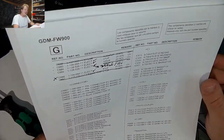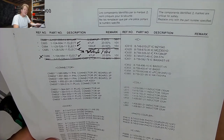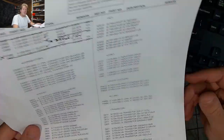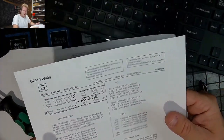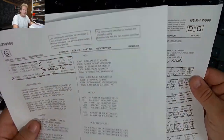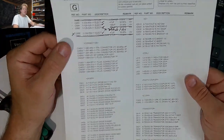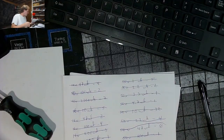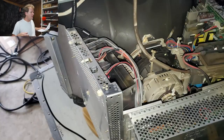Now, some interesting things on the G board cap list: C685 — in the manual it lists a 10 volt, 100 microfarad capacitor, but in actuality on the board there was a 10 volt, 220 microfarad capacitor. And that's what I changed it to — whatever was on the board, not what was on the manual — because this is apparently a revision that's not on the main manual. It wasn't as if someone had gone in and replaced this specific capacitor to this value — this was done in the factory. It was the same factory capacitor, just different from the manual listing. I checked it like 25 times as I was doing it just to make sure everything was good.